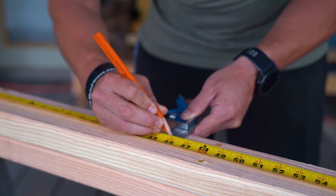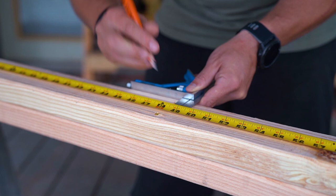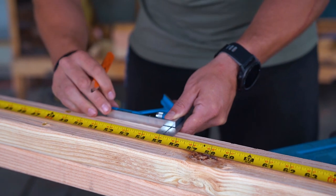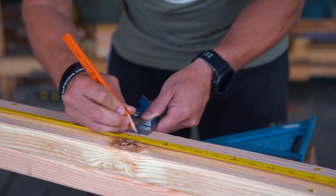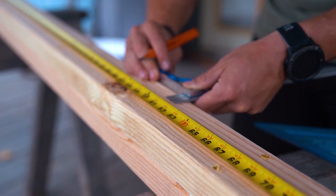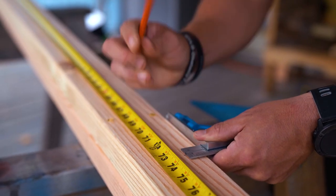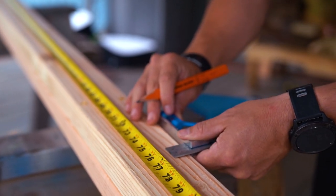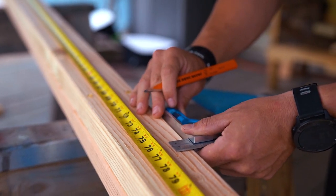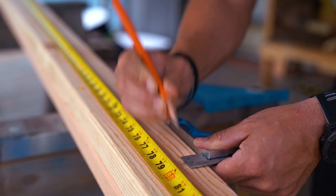One thing to make sure when marking is that the square is all the way flat against the board, otherwise your holes will be off. I'm marking from the outside edge of the board — this is for the left side. When you do the right side, you also have to mark it from the outside of that board — that's very important. I'm going to go up to about 79 inches to accommodate taller people, say six feet or six-foot-five, who might be doing back squats.